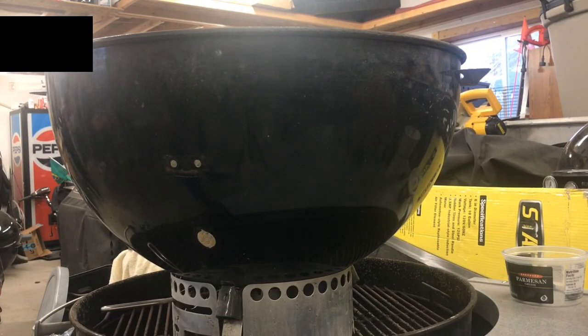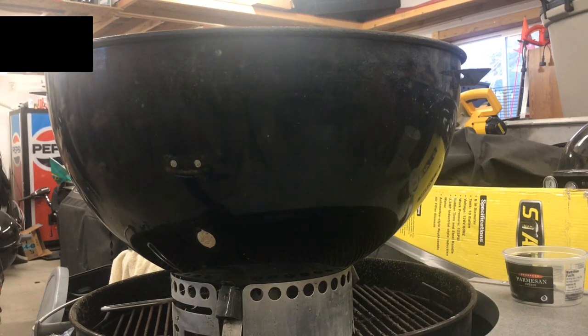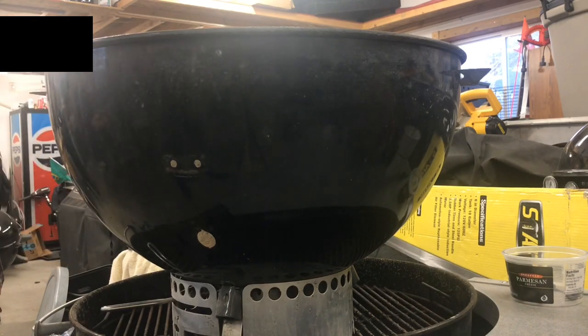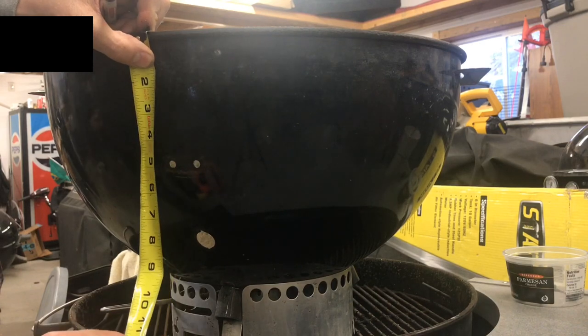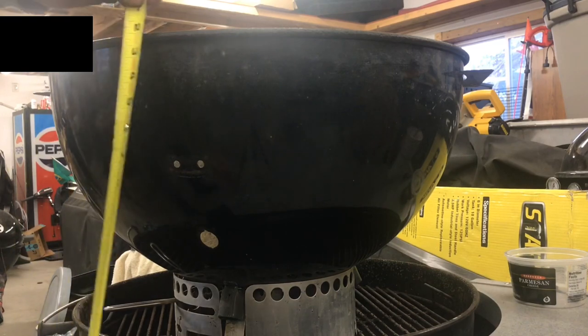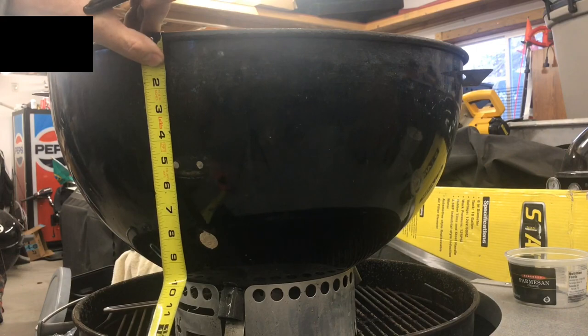The first thing we want to do is figure out where we're going to drill these holes. From the top of this kettle down to the bracket that feeds the propane into the kettle, we need to measure that. I just take my tape measure and come down — it's about five and a half inches to these two holes. Then down to the propane hole, we're looking at about eight and a half on center.